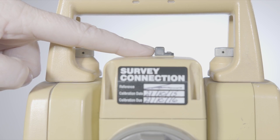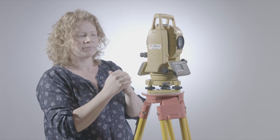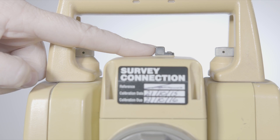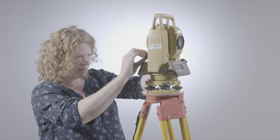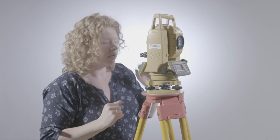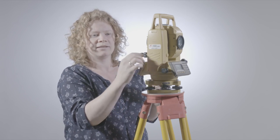On the top here, it's a gun sight. When I'm trying to approximately locate the target, you can use the one on the top or the one at the back. If I move my head around until I see a triangle of light, I turn this left or right and up and down until that triangle of light is exactly over the target, then put on the lock. When I look through the telescope, the target will be somewhere within my field of view, and I only then need to use the fine tuners to bring it onto the exact position.